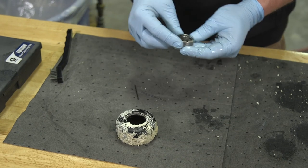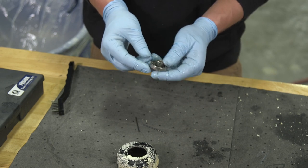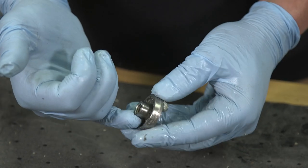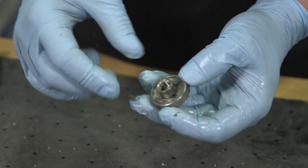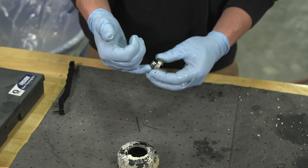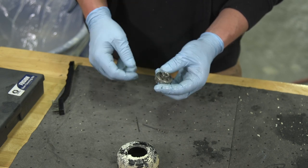All right, now we're at the air cap. And this goes for the Fusion air purge gun or the PC gun: this thing needs to be clean. You've got your front O-ring that rubs all day, every day around this cylinder here. So if you put that into your gun dirty, or if you put a new cartridge in and you put this in dirty, you're going to wear out that front O-ring right away. It's going to mess with your pattern. It's going to make you think your cartridge is bad, but it's not. So this needs to be clean, and I'm going to show you how.